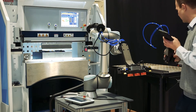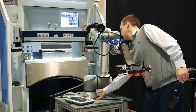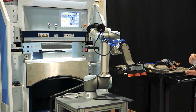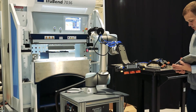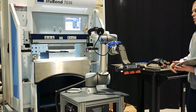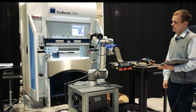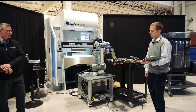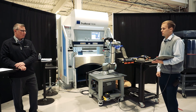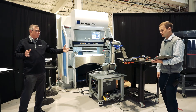As we were developing the gripping system, there was a need to turn a lot of parts. This gripper actually has the ability to rotate the part 180 degrees. When we rotate the part 180 degrees, that allows the robot not to have to set the part back down and go over and re-grip it — you don't have to do the reposition stop. What that gets the customer is more parts per hour, which is more revenue.